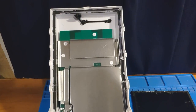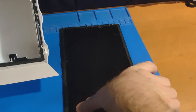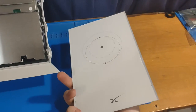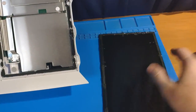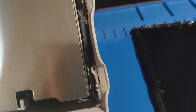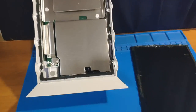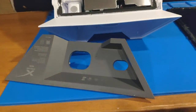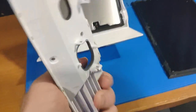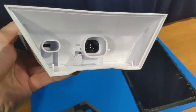There aren't any screws in this thing. You can heat up the adhesive with a heat gun to make this a little more elegant — I chose to pry it off. If you do that, be careful because glass will chip and possibly end up on your floor where you'll step on it. This little plastic thing just clips on and off; you don't actually need to remove that. I was winging it when I did this, so I took it off.